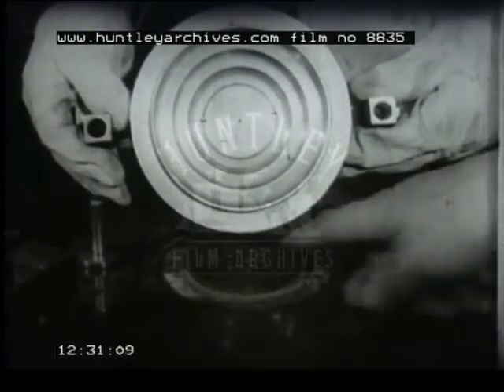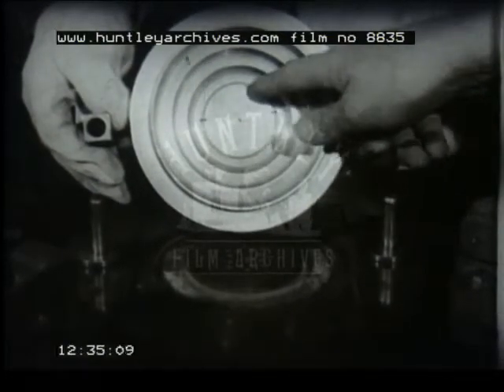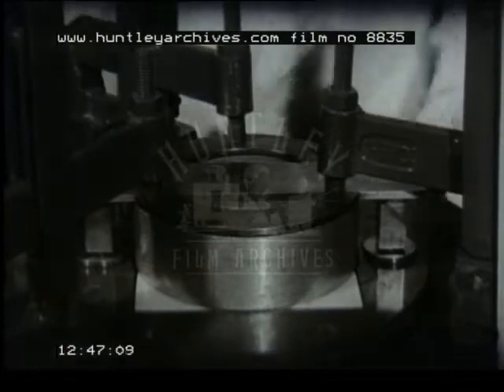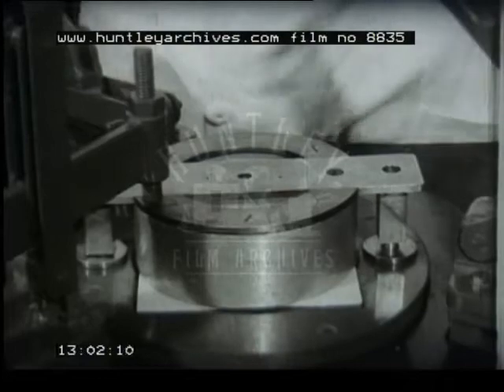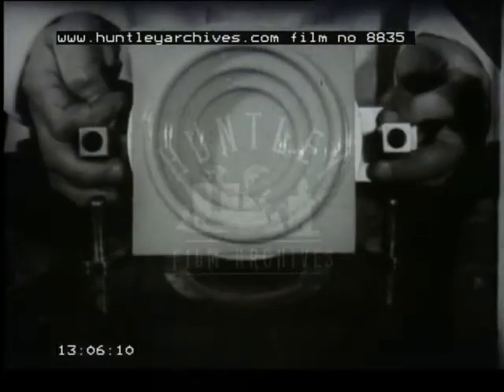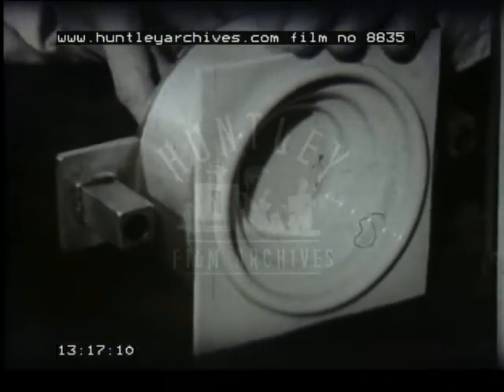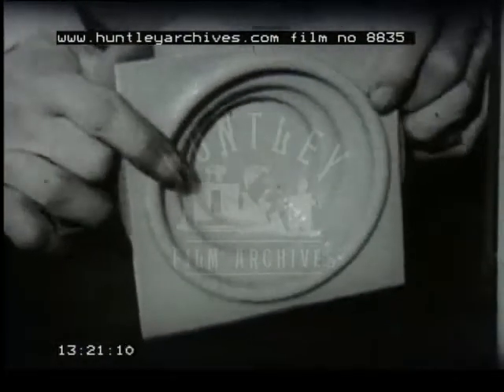Now we come to more complicated shapes. These can be made by blowing into a mould. The air is introduced through a diffusing plate and the mould is vented at the top. Sharp edges to the series of rims trap an air cushion between the sheet and the mould, reducing mould markings. Considerable air pressure — about 50 pounds per square inch — is used to get good shaping. After cooling, the pressure is reduced and the mould removed. A compressed air pipe applied to the air vent releases the dish, which is entirely free of mould marks on the inside.